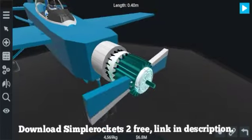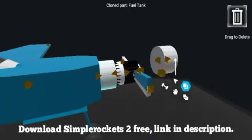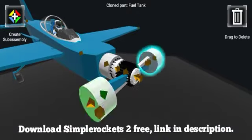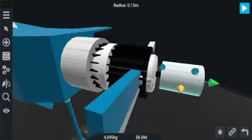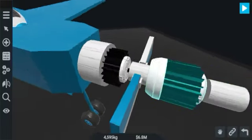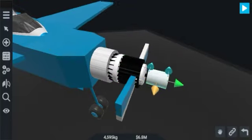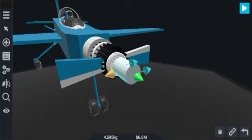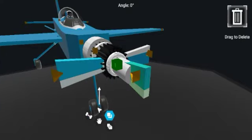Once you make the first motor set, the blade from the second motor will come with the inverted input, but also in opposite directions. Like the first set is set to clockwise directions with blades in clockwise, the second motor set will have anti-clockwise directions and inverted input also. So you must remember that.